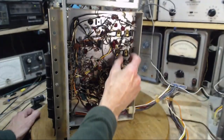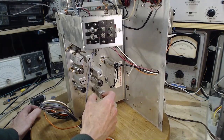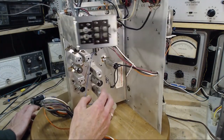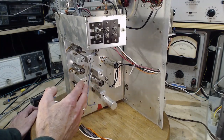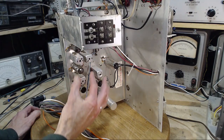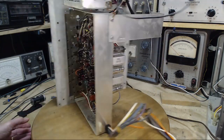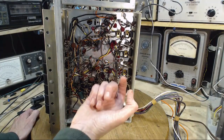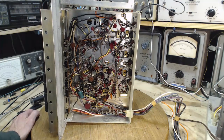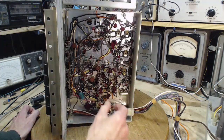Get two separate rows of IF. Two. It's hard to say for sure. I'm not sure yet. A lot of these radios use the... I think there's two tracks here. So a lot of radios have a dual IF transformer, if you like. Looks like this doesn't. Looks like it has an FM track and an AM track.